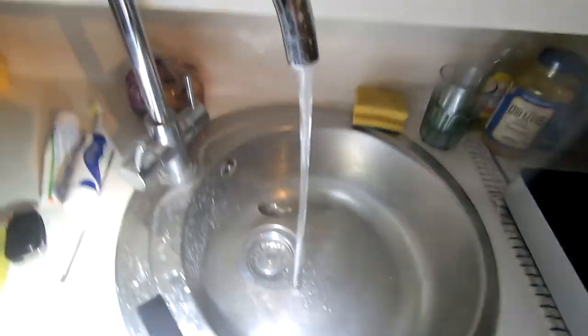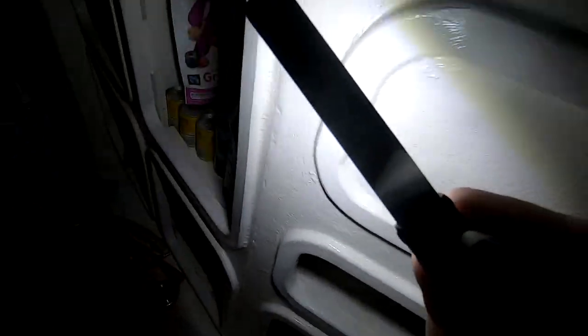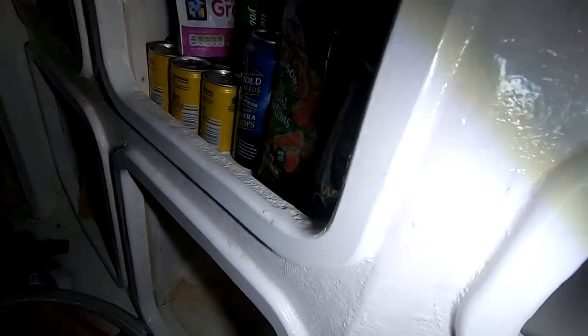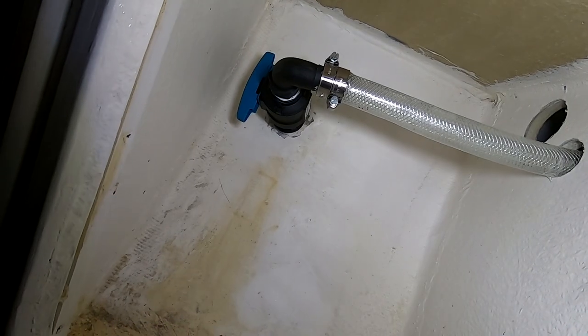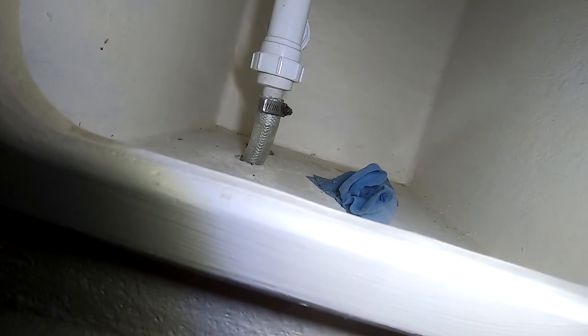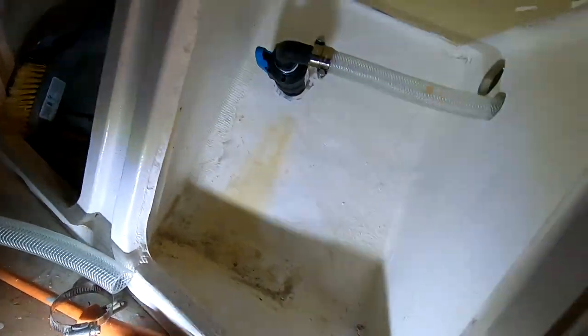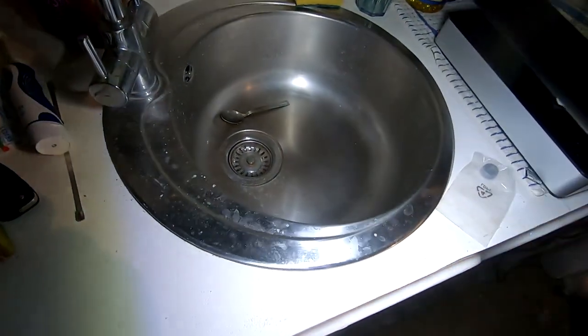I probably had a sound fail there due to flat batteries, but I'm just testing the pipework. If I didn't get it on the last video because the batteries screwed me over - that one's got a single clip on, and I made a fresh hole for another fresh hole to come through. Double clips below the water line, so the sea cock is shut. The reason it's shut is I'm just making sure that everything is watertight - and it is. So I should now let it rip - and away she goes. Another job done on the survey list. On to the next one - but not now, it's bedtime.